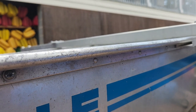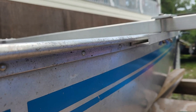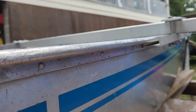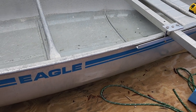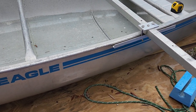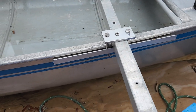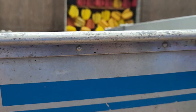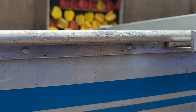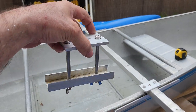This is a newer 1990s model and it has a very good aluminum gunnel, so it's plenty strong. But I chose to go with a longer one to involve more. As a matter of fact, the rivets — if you can see here — the rivets are about six inches apart, and I'm going to put rivets in the middle of those so that they're doubled up. And this is it, pretty much right here.